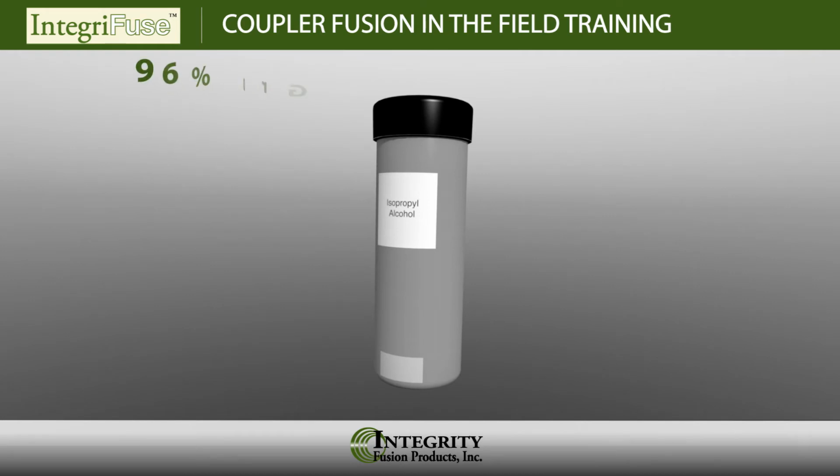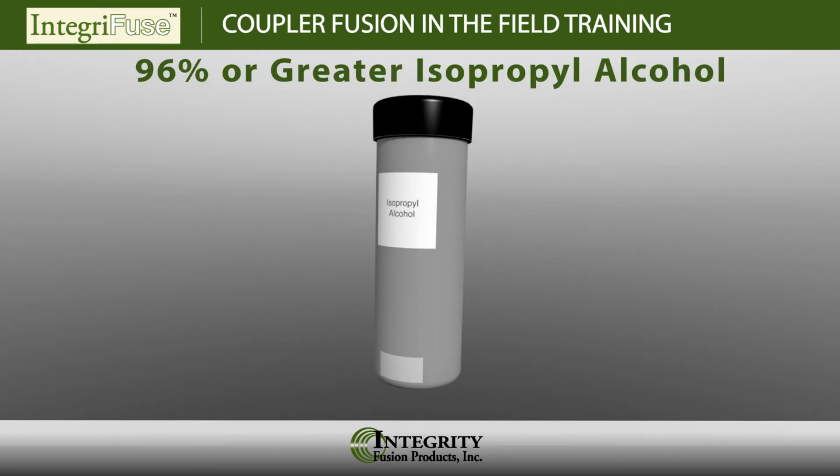Pipe cleaning material to be used to make sure that the pipe surface is clean and free from any type of contaminants that may be encountered before and after scraping. Plain water may be initially used to remove the surface level of these contaminants such as dirt and mud. However, water cannot be used to clean the pipe surfaces once the pipe has been scraped and virgin material has been exposed. A 96% or greater isopropyl alcohol solution with no additional additives and a clean lint-free rag is recommended to remove contaminants and has been found to be highly effective.